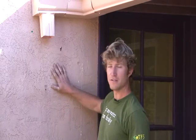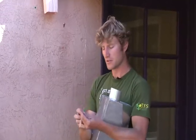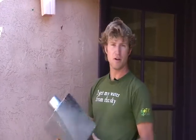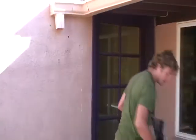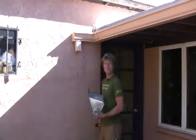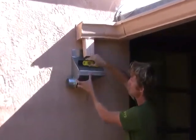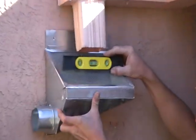The way that we're mounting it — this is a stucco wall — we have plastic wall anchors and we're going to be putting a screw into those. Depending on the surface, sometimes you'll need to use a hammer drill. This drill has a hammer setting to go through block or concrete. The things to watch are whether it's flush on the wall, and you want your screen to be more or less level to maintain as much water going into the rain head as possible.